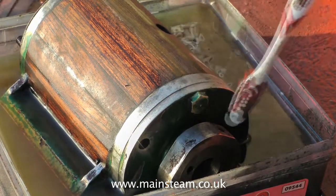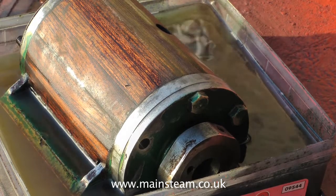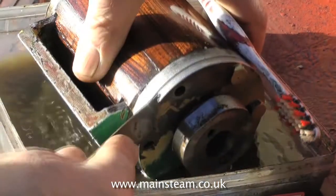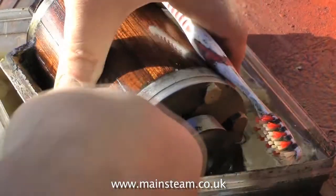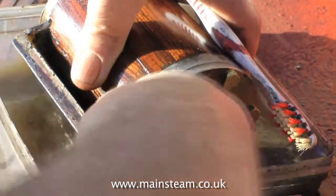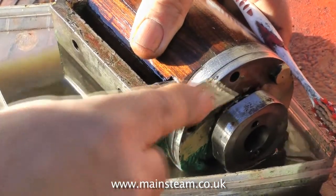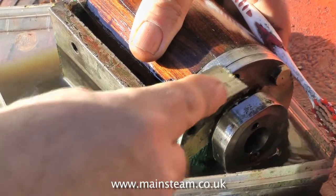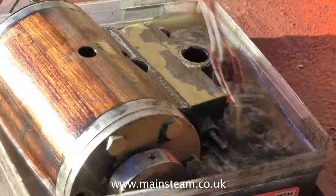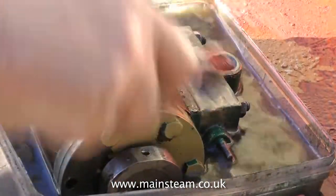Here you can see me spreading the thinners around the cylinder. Don't worry about the wood part — this wood was very badly oil-soaked, so using the thinners is just going to leach most of the oil away from the wood. If you want to do it the hard way, you can scrape with the edge of a metal ruler, but there's no point doing this. Just leave the cylinder in the thinners, do something else, and when you come back to it, miraculously, nearly all of the paint will have fallen off the item.